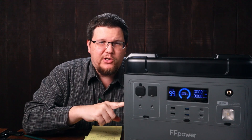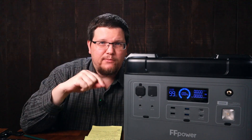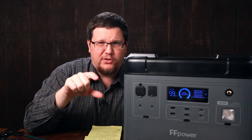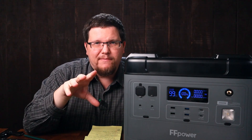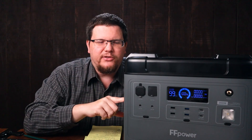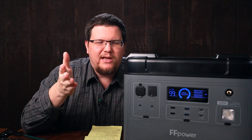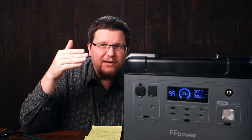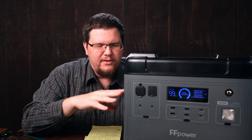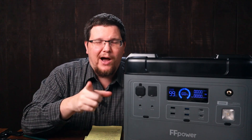I'm not saying that you can't do that for cheaper — you absolutely can — but you need to know what you're doing. You're going to have to watch a bunch of YouTube tutorials on how to put battery management systems together, because you have to balance your battery packs. If you have lots of different cells, you have to make sure that they're charging equally and not overcharging certain cells, as well as managing discharge.